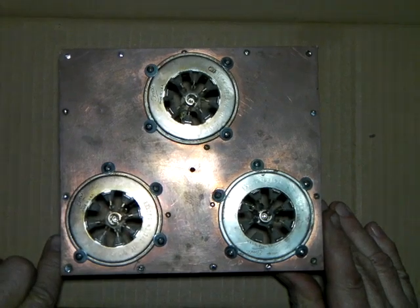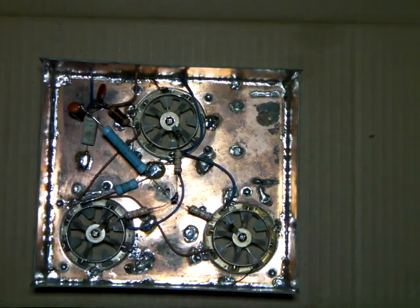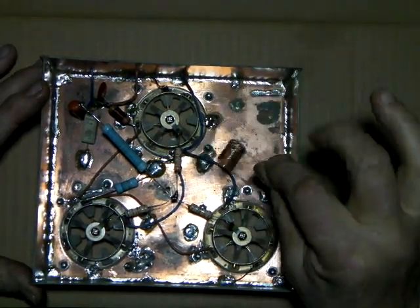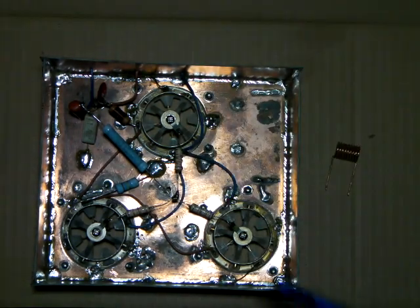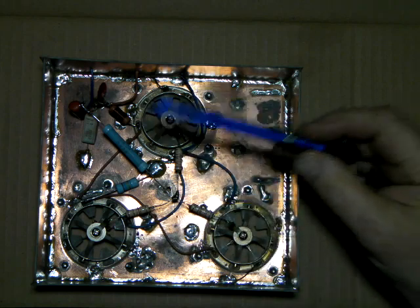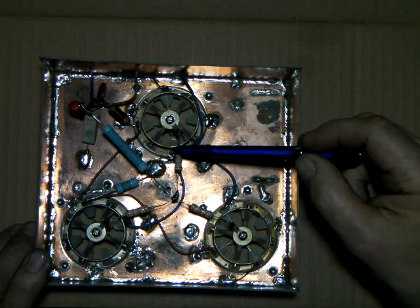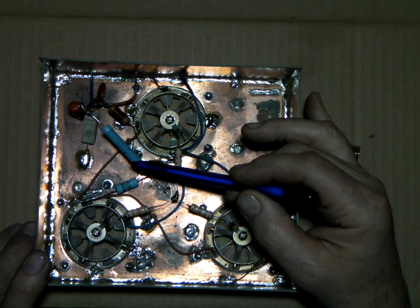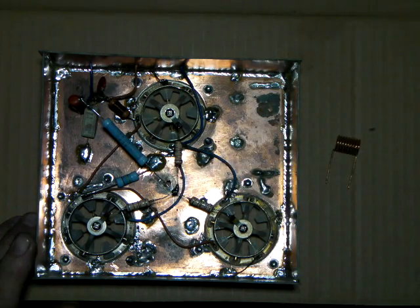If you want to look into the future, reach into my time machine here. If you were going to build a 3-tube unit, it would be the same thing. I haven't got the input coil mounted in this yet, so the 2 trimmers that would be connected to this aren't here, but I have the tubes wired in with the parasitic chokes, and here's our resistor again that we're going to be talking about, this resistor. In this rig, I've actually got a 619 ohm at 5 watt resistor in there. Okay, we'll get discussing that.